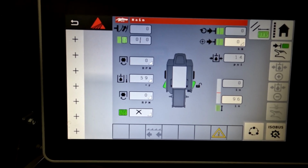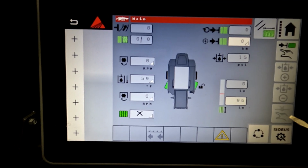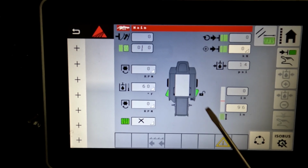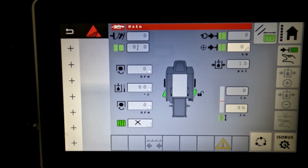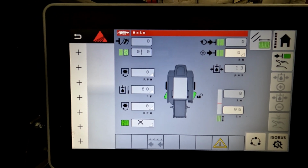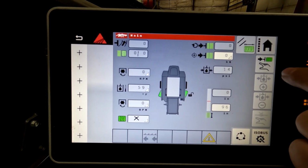You can come in here and manually increase and decrease your pressures. Here you can see this is a manual knotter cycle. So if you have a minimum of 8 flakes on your count here, that icon will light up and you can tie that bale off and then eject. Sometimes it'll populate here as well. And then that's the icon that you'll need to go into auto or manual mode to increase and decrease your density.